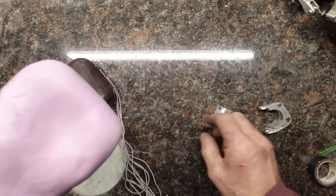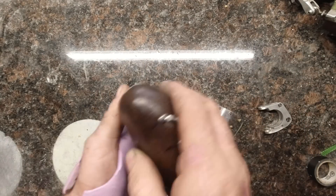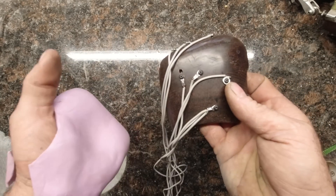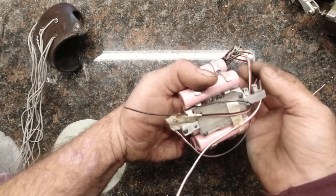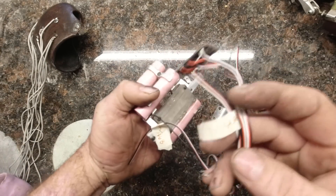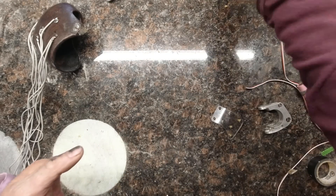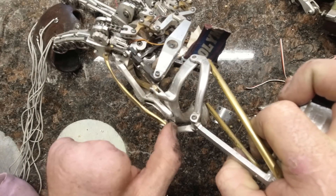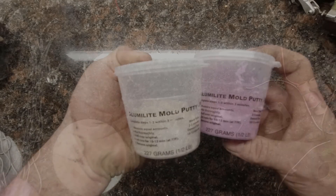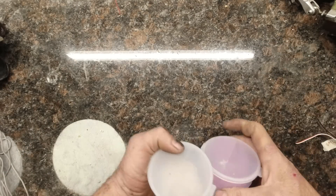So on the new build, I'm going to start by making a silicone glove and mount the dry contacts in it, then lay up a fiberglass hard socket to fit over the silicone glove. I'm looking at laminating the signal wires into the fiberglass to help with wire management. I've got a good bit of the forearm parts already built — that's where I'm going to focus most of my attention right now. After I get the hard socket built, I'll build a new gauntlet and wrist gimbal, then I'll be able to get all the electronics dialed in and reliably working before I go about building fingers and placing the mounts. That's where today's video comes in — I thought I'd show you how to use a Lumalite silicone putty to make a socket liner.